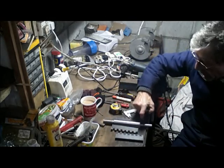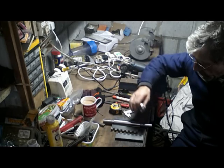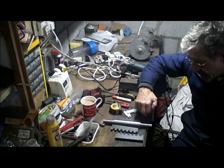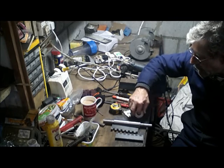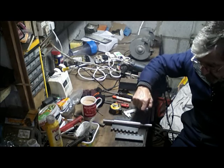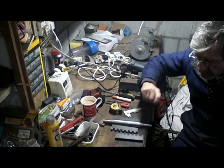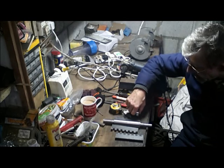So okay, the bearings will be pressed onto this. My game plan was put this together, press them on, and then press the outside plates onto the outside of the bearing. That means if I have to take it apart to do any final work on these, I'll be unpressing and pressing and unpressing. So I'm going to have to come up with some kind of a plan of a bearing cap. I don't want to be just bending a bit of steel around it and sort of bolting it onto the top of the whole thing. I want something pretty solid.